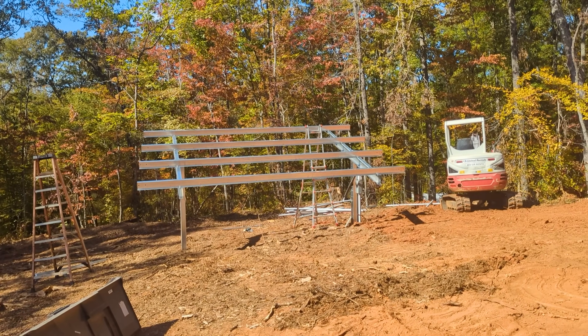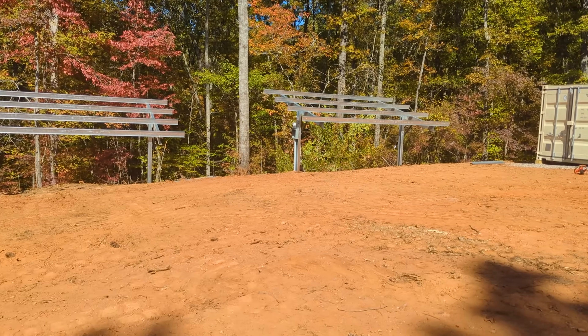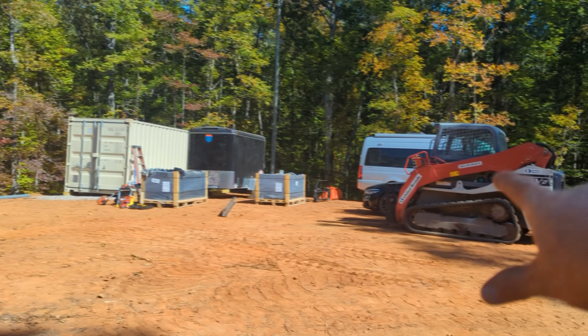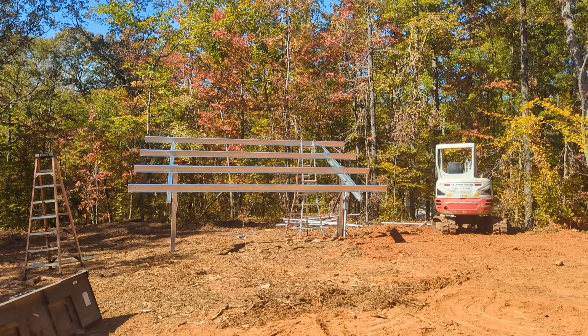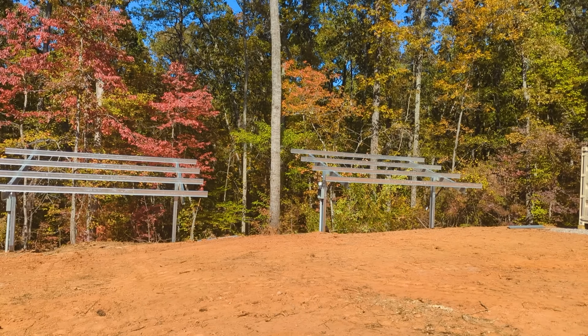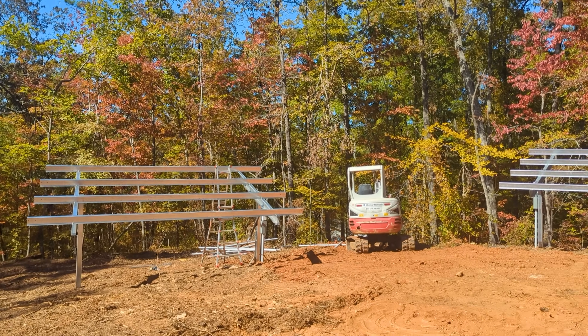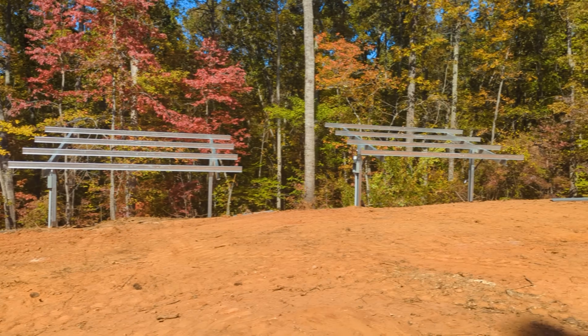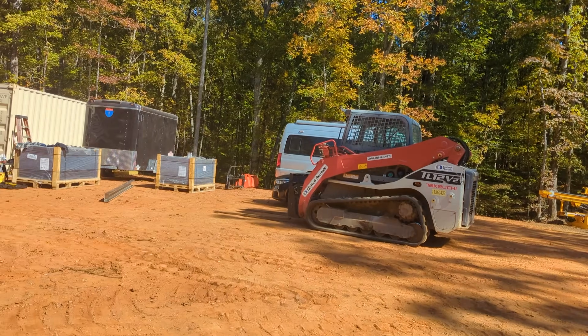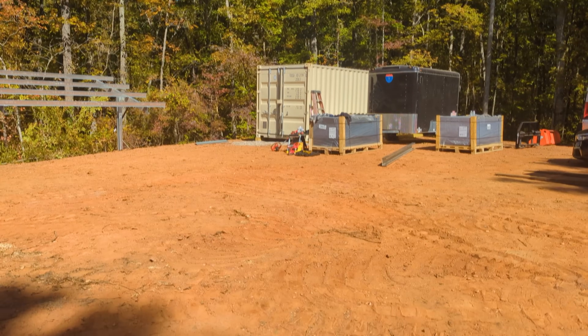With a two-post system you can really beat the terrain. Because the building could be over here, I made a southeast-facing array that's really going to cook first thing in the morning — that's what he's going to get. It operated that way this morning and it's going to be great. Bifacials of course will help, and there are no pines around here, so all the leaves will come off shortly and that's going to help tremendously in the winter. A lot of people want to hide their solar — they don't want to see it from their house. If you've got enough property, go ahead and make a hole. This hole is probably a hundred by a hundred — roughly a third of an acre.